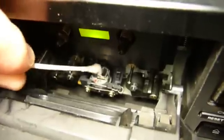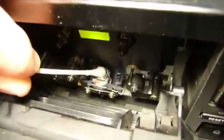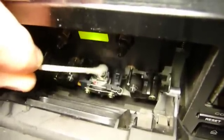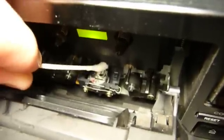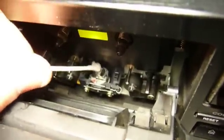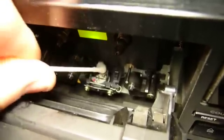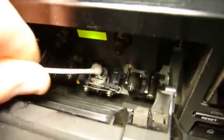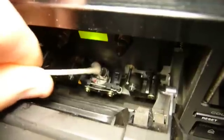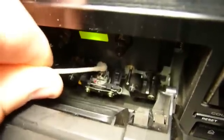When you're done cleaning your deck, allow ample time for everything to dry. If you do not allow the pinch rollers, capstan drives, and the heads, and every other part of the tape transport to dry out, you will have oodles and gobs of tape that get eaten inside the deck. So definitely don't hurry this. This is also a good reason to use the highest percentage of isopropyl alcohol you can find, because it will dry faster. Just let convection do its thing — don't try to hasten the process with a fan, because you may blow a whole bunch of dust into your deck.